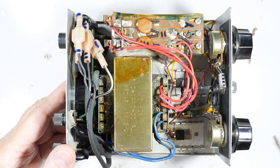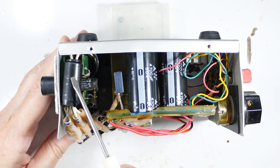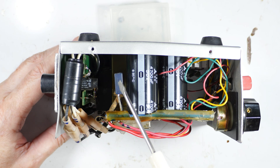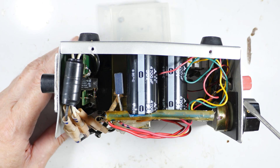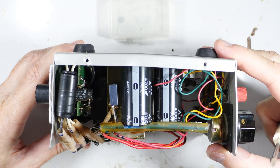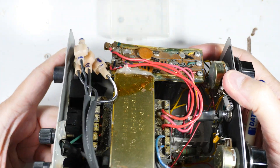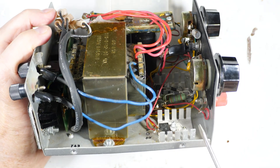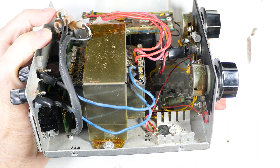There's the pilot lamp right there. Over here is a filter — the AC wires just pass through this ferrite filter to remove any noise. Here we have a full-wave bridge rectifier and a couple of heavy-duty capacitors: 4700 microfarads at 50 volts. All these wires are Radio Shack wires.